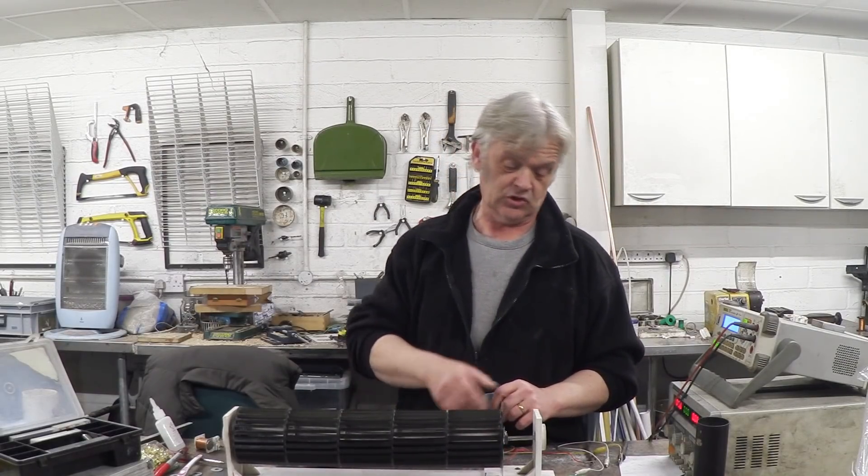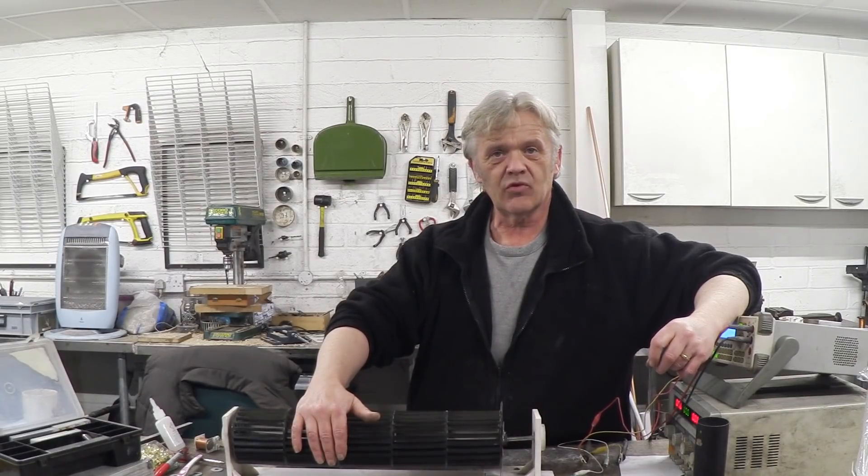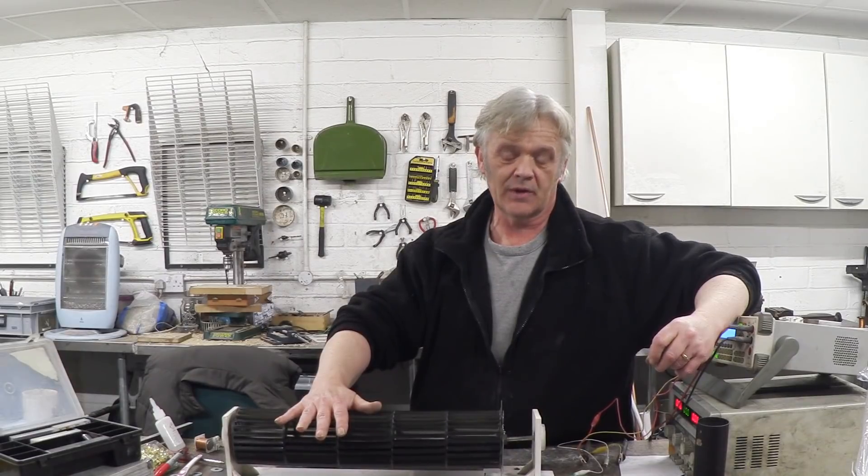There are lots of different ways of approaching this, and my thought is that different ways suit different configurations. The pancake coil didn't give a particularly good result — it was a single pancake coil wound quite large. The best result was just from sticking the magnet straight on the rotor and putting a coil up against it. I think the most interesting result is this idea of switch reluctance — there is an awful lot of research on switch reluctance devices and they're very interesting for good reasons.